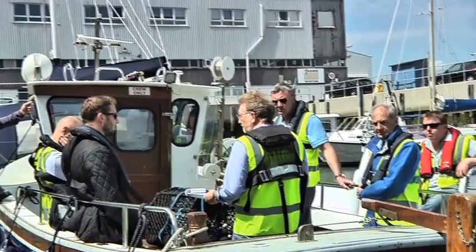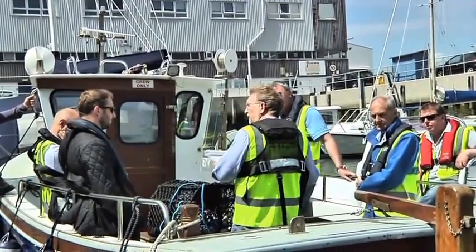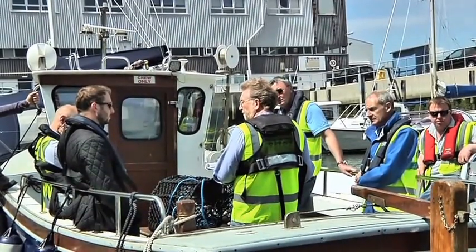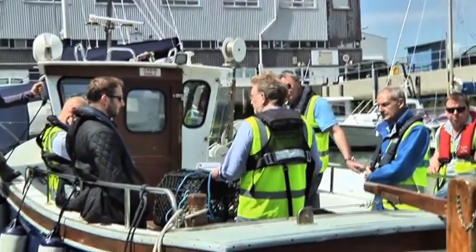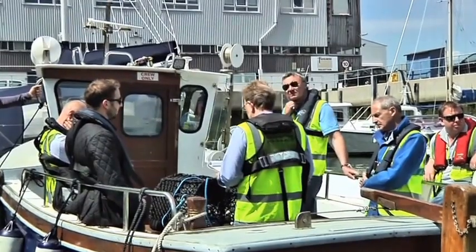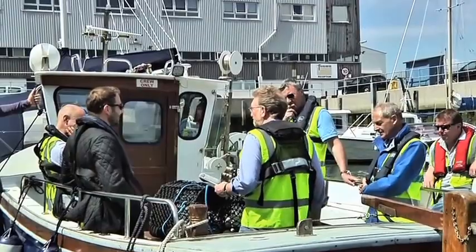If a big wave knocks the boat over, or something else does, and all the people get flung over to one side, it's accepted that the helmsman is probably going to be able to stay in his position because he's got something to hang on to. So he's not included in the weight on the side that is how far over the boat's being heeled, which is very convenient when you're trying to measure what's going on.